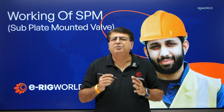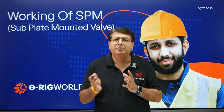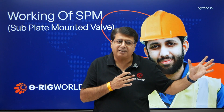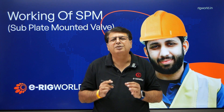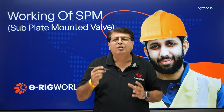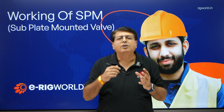The equipment part is very challenging because it's complicated when you compare it with the surface stack accumulator system and subsea accumulator system. The subsea accumulator system is very complex because there are two fluids that work, and all the fluid that is power fluid, after doing its work, is drained to the seabed.